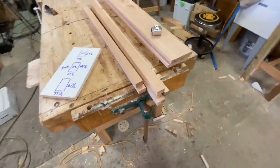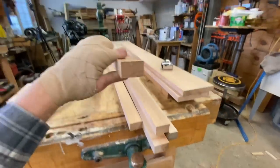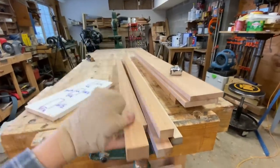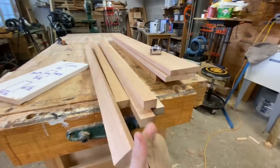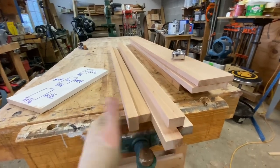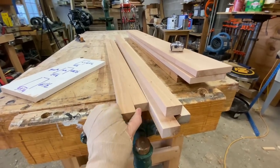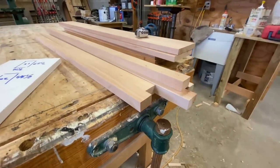The last component to our window frame assembly is this little batten strip piece - it's one inch by an inch and a half. This is going to serve as the sill or sill extension; perhaps an apron will go under it. We're going to pocket screw this all together. We thought it'd be a nice little detail to add because it sort of mimics the appearance of the outside window trim and gives it a little more detail.